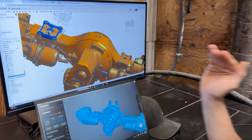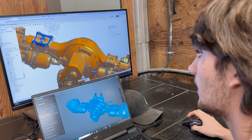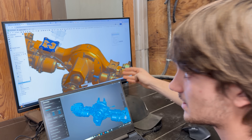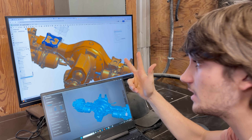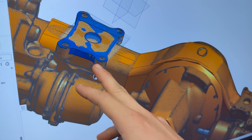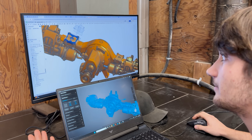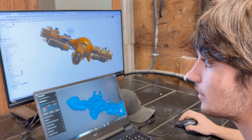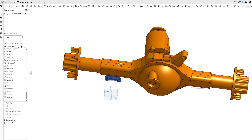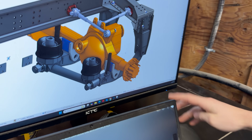Next I use the mesh intersection curve — my custom feature — and I select the plane I just created and the mesh. That gives me the outline of this surface. Then for step 3, I use the outline I just found, extrude it, and I end up with a bracket. I repeated this process over and over for the entire axle and ended up with the final result — a solid body. Now that we have the solid body of the axle, I was able to add it into the assembly with our suspension frame rails and design the bracket that's going to hold it into the suspension.